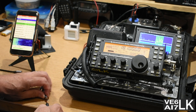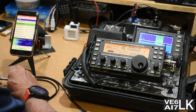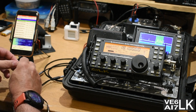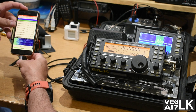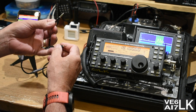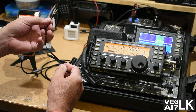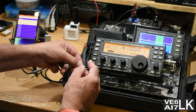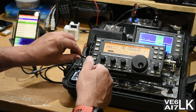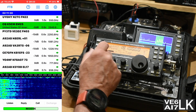Now I'm going to plug all the cables together. Those TRRS connectors are nice and stiff because they're brand new — make sure they're plugged in real well. I'm going to plug in my Lightning connector now. Remember what I said: the headphone doesn't go into the headphone out port. Headphone out is the audio out from the phone, so it goes into the microphone jack. And then the microphone connector going into the phone comes out of the headphone jack on the side of the radio. Turn the volume back up about a third of the way.